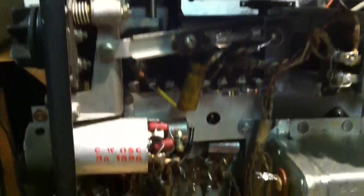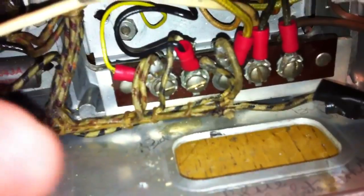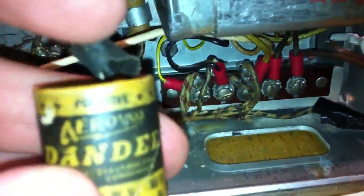Here's a look at the underside of this BC348 radio. The work that I've done so far — I've still got to clean up some of this switch wiring here. I cleaned up — believe it or not — a lot of the power supply leads. All the solder joints were a mess. I got soldering lugs soldered onto the wiring. I did replace some of the wiring because it was in bad shape, and redid a lot of the solder joints on the power supply. The guy that built this just really wasn't that great at soldering — used a lot of solder, bad joints, and lots of electrical tape.